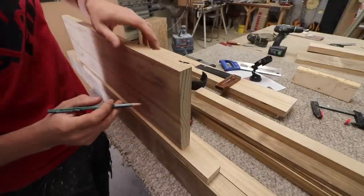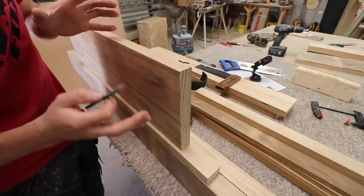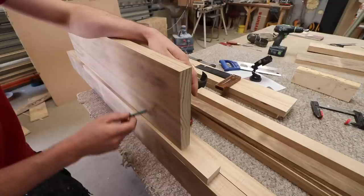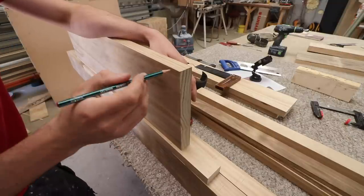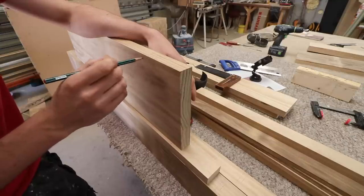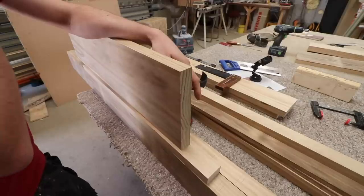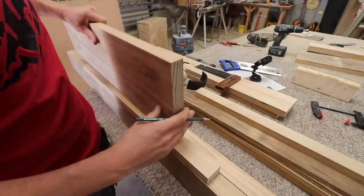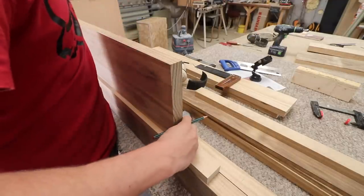And the other bonus of that is glue from this joint when you push it in together to make the final glue up. It doesn't push all that glue off and seat it within the groove where the boards go, and that can be a bit of a pain to clean out. The edge of the piece of timber on the door will actually push it out to somewhere where it's accessible to clean off, which is a small advantage as well. So I set up, this dictates our absolute maximum height of the tenon away from the face.